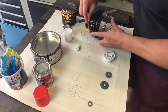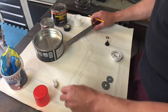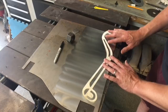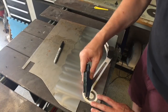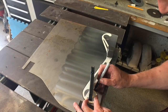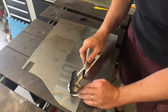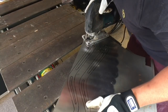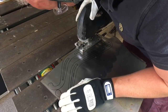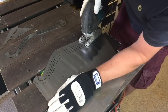All of my projects usually start with a pen and a bit of paper, and lots of stuff to draw around to make the shapes that I would need. I did this for the arms and the base and basically everything — it follows the same kind of principle. Then I just cut it out as a template, mark around it, and then on to cutting out, which I tend to use just a jigsaw for. I'm sure if you've got a fancy plasma cutter it would equally work as well. I use a fine blade here — it's only 1.6mm sheet steel I'm working with, so it's relatively straightforward.